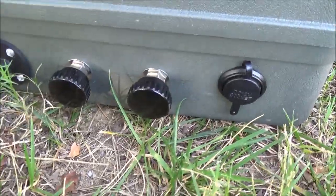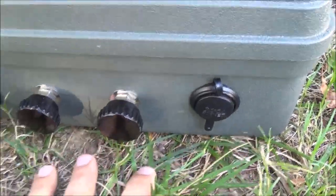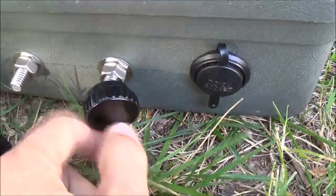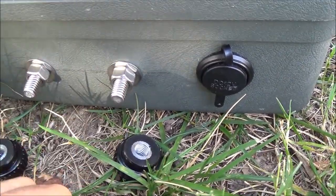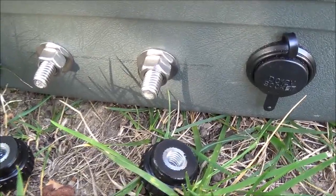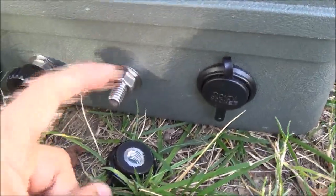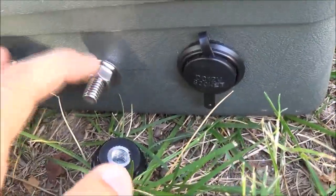That led me to think I really need to make some terminals. I'd seen these on other YouTube solar generator videos. I'm not completely 100% done — it's still prototyping — but basically I've made these so they come off and expose your positive and your negative. These are 10-gauge wires hooked right to the battery itself. There's not even a fuse because most things I'll hook to it will have their own fuse, so it's basically like connecting directly to the battery without tearing the whole thing apart. These just screw right back on, and I plan on painting one red and one green so nothing could accidentally short across them.